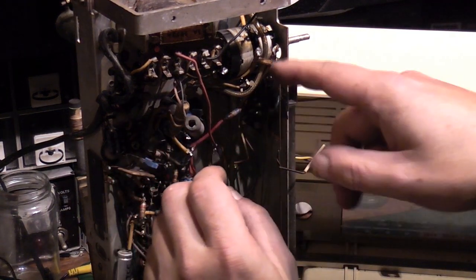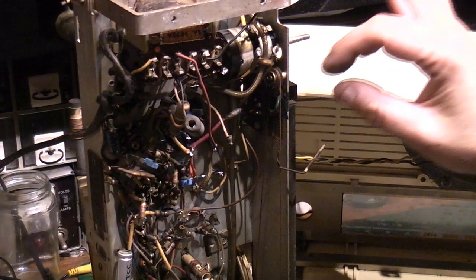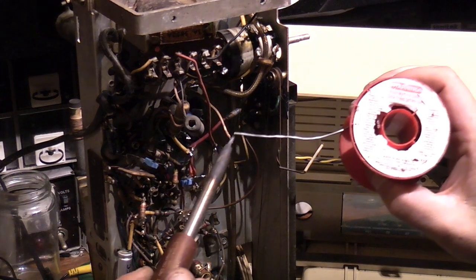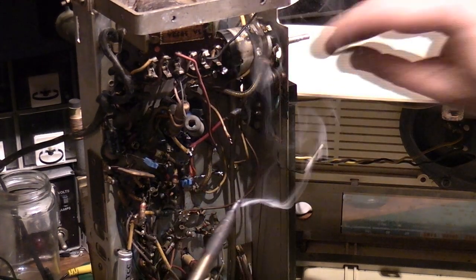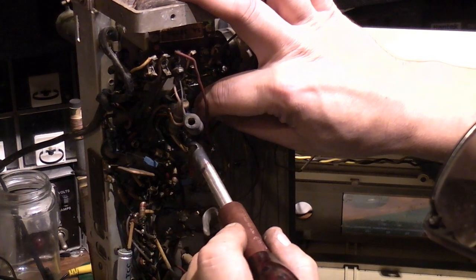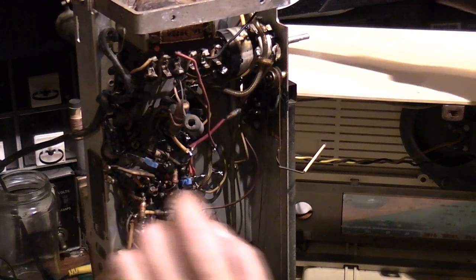Now all we need to do is we've got that last wire there, which is the ground wire. I think we will actually clean some of that stuff off there, because we need to just basically solder that to them other ones that we twisted together and tinned up before. Let's see if we can get that. There we go. Lovely, that was easy. A little bit of extra solder to that. And we're just going to solder that to, there we go. Basically we've soldered that directly to the centre point where we connected all the grounds from the capacitor up.